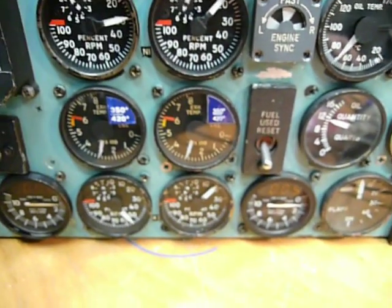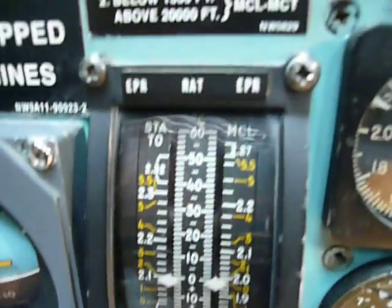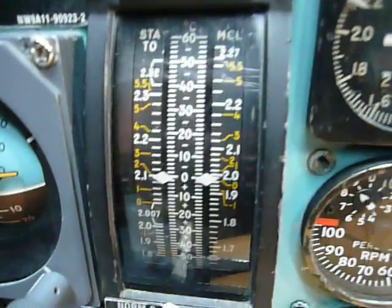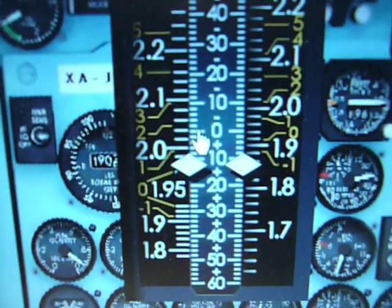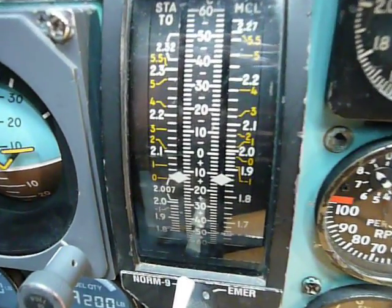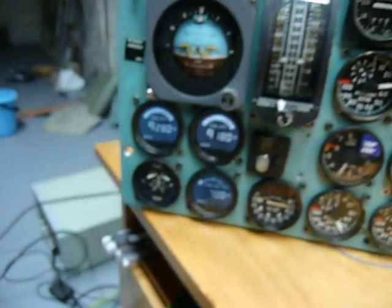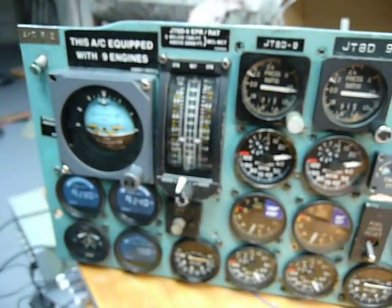A little boring. And the general ambient air AT will put a correct temperature into the air AT EPR gauge, and it is also controlling the flaps. So the flaps here are at 15 and the air AT shows 12 degrees centigrade. So if I turn on this controller, these two gadgets will start to show 12 degrees centigrade, and the flaps are on 15. So that's all controllers started for the engine instrument panel.